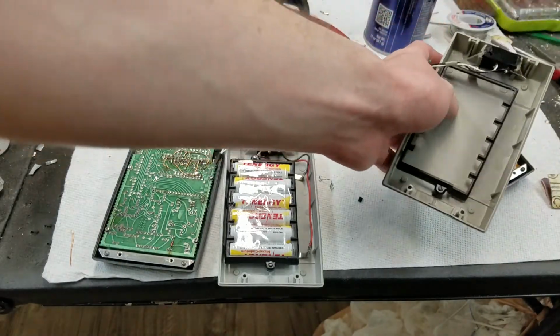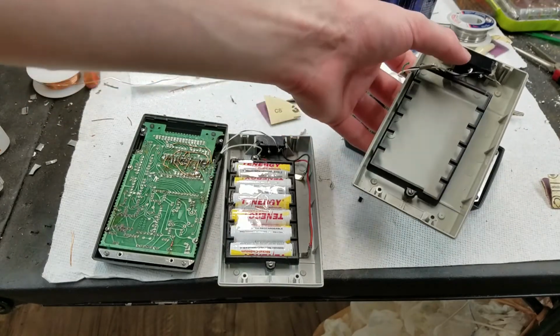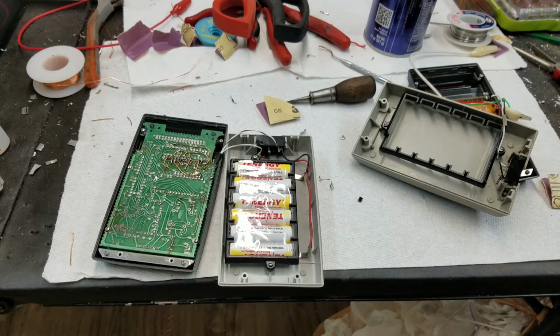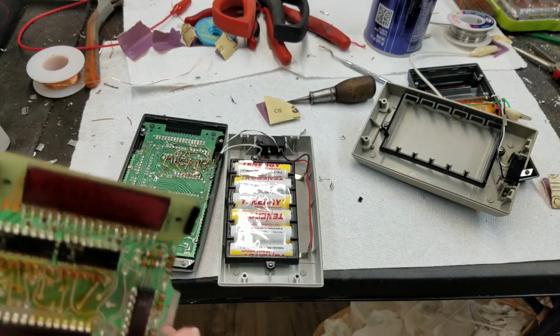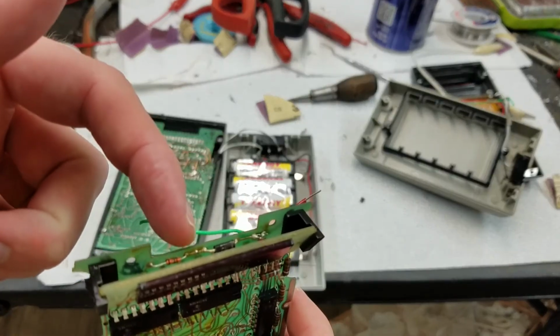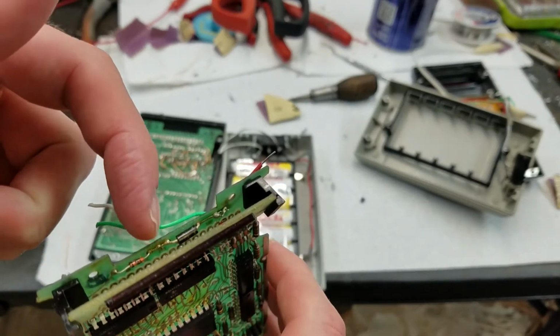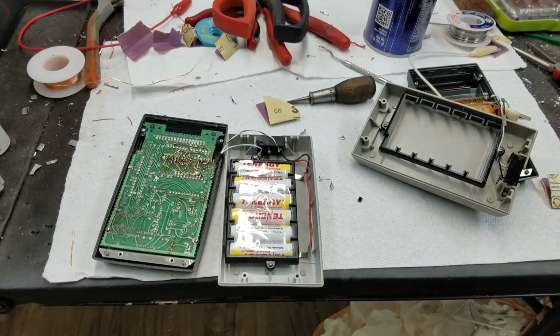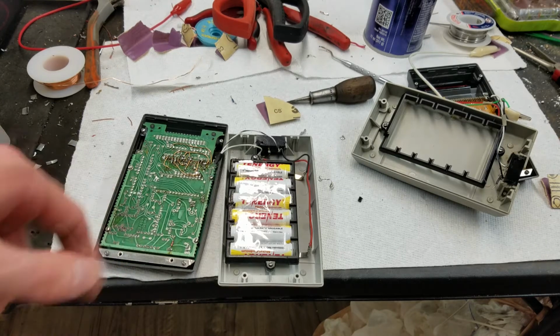You can see on the back here, that white wire relating to the AC power supply. So my thought is, the idea there is whenever you have the AC power supply plugged in, that's going to be feeding 60 hertz pulses, because it's halfway rectified from the AC power supply. Going to be feeding 60 hertz pulses onto that line, and my best guess is that is so that the display will never time out when you have the charger plugged in. Is, as far as I can tell, the reason behind that. If that doesn't work on this machine, that's no big loss.